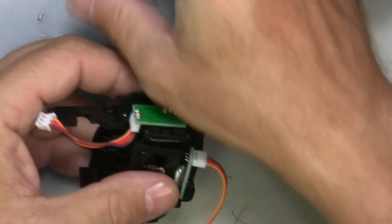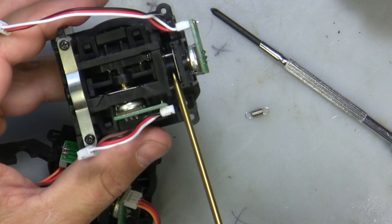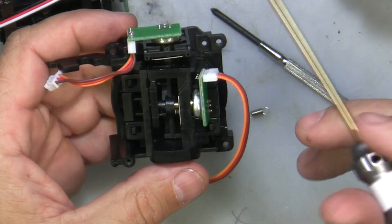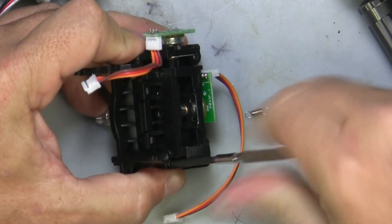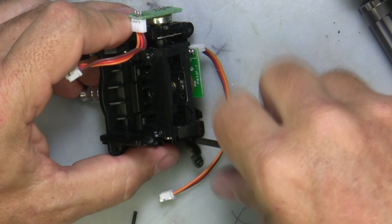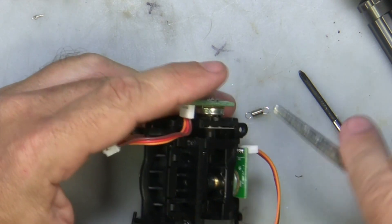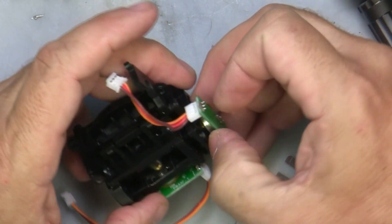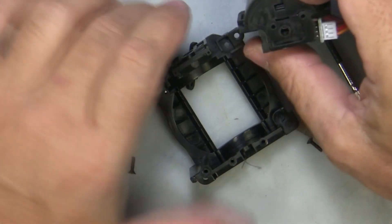One other thing I just realized — for the rocker to work, there are these little pins here and here on the side I took the rocker from. We've got to take these pins out because that's what makes the rocker work. We've got to take those pins out of here and put them in here and here on the other side. To do that, I'm going to have to take this whole assembly apart. We're going to pull these screws out. Then to take this gimbal assembly apart, you've got to pull this plate out here — see this little plate? You've got to pull that out so that you can pull up the pot. The pot comes out. So now we can get to the pins.